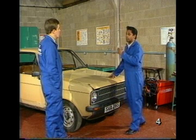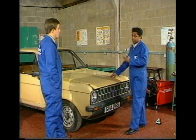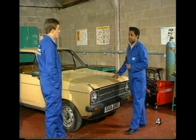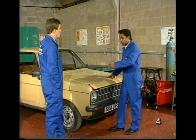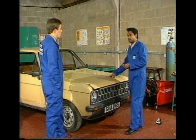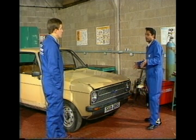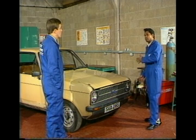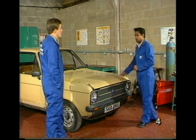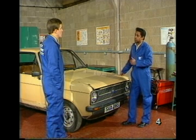And of course, you must all make sure that the garage itself is well away from the house, that it is well lit, well ventilated, because welding does produce dangerous fumes. And also, you must plan your escape route. Make sure that there is a good meter clear all around the car. And always, as a good measure, make sure there is somebody watching you when you're welding, especially when you've crawled underneath the car, working under there, somebody to watch over you.